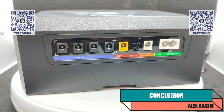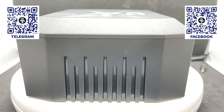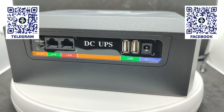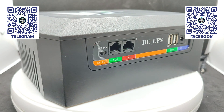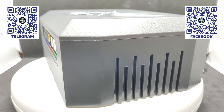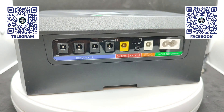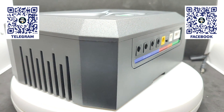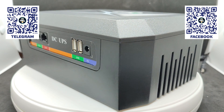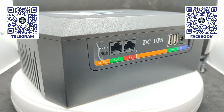As we can see, there are both positives and negatives. Positives: a large number of ports in commonly used voltages — 5, 9, and 12 volts; the presence of PoE at 48 volts is quite rare; battery balancing appears to be provided; port power generally matches declared values; automatic turn-on when external power is supplied; ability to work from both AC mains and a 12 to 24-volt DC supply; and the screen displays key parameters. Negatives: one UPS unit was non-functional, possibly due to falling screws; capacity is significantly below the declared value, and according to reviews this is not isolated to my unit. The batteries are easy to replace and there is room to fit 12 cells instead of 8, but one would expect to get what is advertised. The device is overall quite good and convenient, especially for PoE backup, but it's important to understand what you can realistically expect from it.